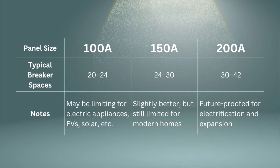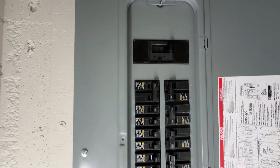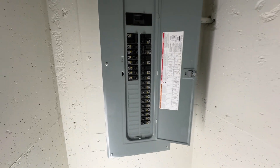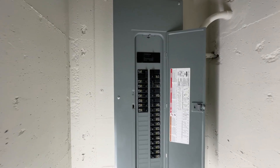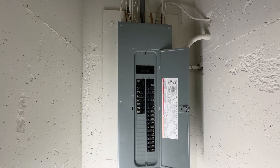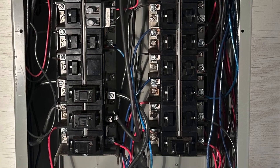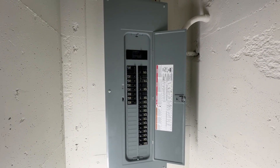The cost difference between a 150 amp and a 200 amp panel is very small, and this panel will last a few decades. Even if you don't think you'll electrify everything now, we may be electrifying most appliances and adding EVs in the future — maybe two EVs. So it's smart to go to 200 amps. You'll also have extra breaker spaces and won't run out. Now we have standard breakers with plenty of room for new appliances.